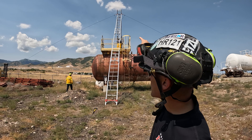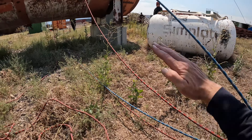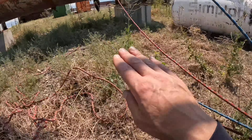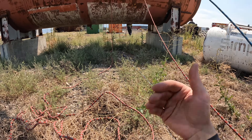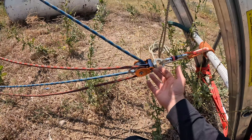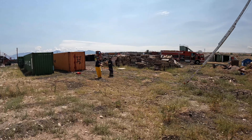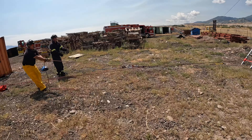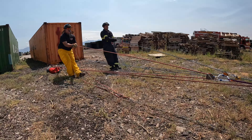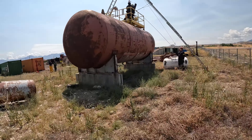There's no point belaying anywhere below the high point, because we're going to have to hoist our patient all the way up — pretty much almost as high as that high directional — if he's straight vertical, to swing them out and lower them to the ground on the opposite, far side. Our main lines are anchored way out there, going underneath the tank to a butt block. That's going to keep our resultant in check. Lines are coming up and then down — a loaded line coming up through the high point, resultant going down, tension line running along one side of the frame bending over, resultant going this way. We're lashed down here to prevent any movement, and then straight out to our main line or main system operation. This is called a butt block.